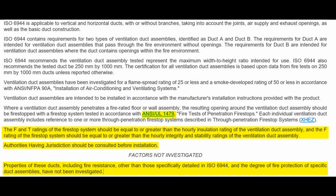Okay, here's the second and last part I'll get into for the UL preamble to the guide HNLN, which is uninsulated fireproof ductwork. This is with a sprayed-on product, apparently. There's a bunch of blah blah about ISO 6944. This is all the lovely stuff about it, which doesn't tell you pressurization, smoke exhaust, something else maybe, right? Let's bring it to reality in construction. Pressurization ductwork is at issue. There's no requirement to fireproof return air ductwork, which is used for smoke exhaust.